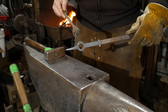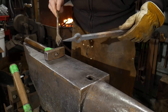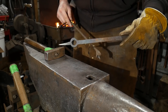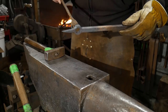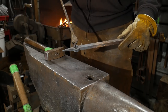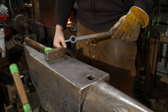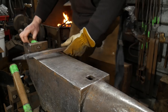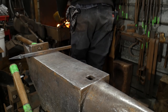Today I'm going to show you the process of plug welding this up. This assumes you already have a hole that needs to be plug welded. If you're trying to make a hole in the bar, the way to do that is to use a slitting punch, cut through it, and then drift it open to whatever size it is. What we're going over today is actually making the weld and preparing the other piece of bar material.